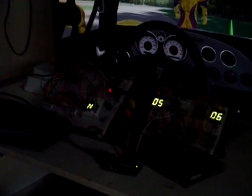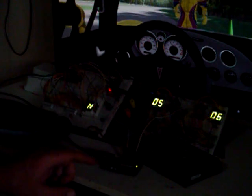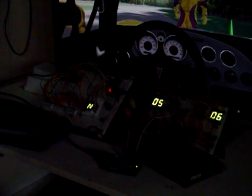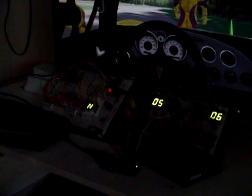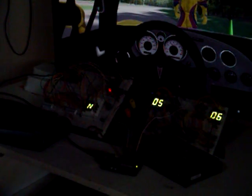Lots of power and ability left. The code on the Arduino is so simple because most of the work is done on the computer. The computer just passes in a couple of byte values. The Arduino just takes those byte values — it's a key-value pair. So if the key is 'update the RPM indicator,' the byte value is just how many LEDs to turn on. All that math is done on the computer. The Arduino is just taking these numbers and turning on bits. It is just so low-powered — it's not really doing anything.